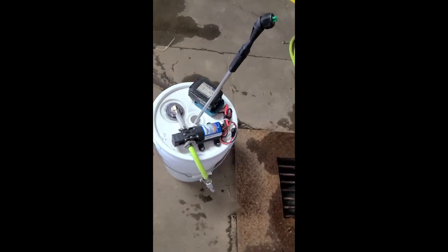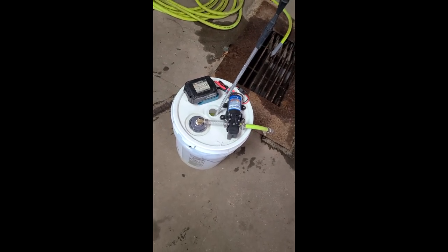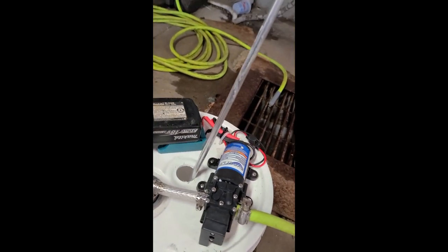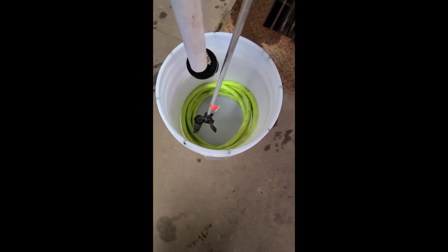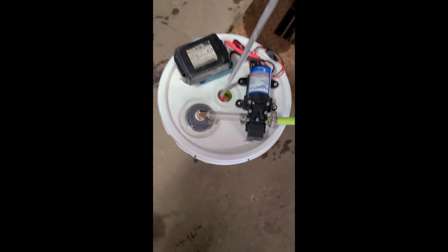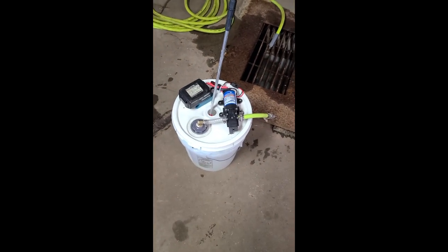They're pretty simple to build and much cheaper to build yourself. This is just a five gallon unit. I got a one GPM pump and an 18 volt Makita battery. I keep all my wiring on the top — I don't want it down below getting into the sealer and getting wet. Everything's self-contained. Got the hose and the wand, and the down tube with a filter on the bottom. Basically that's a five gallon bucket sprayer — pretty simple and pretty cheap to build.